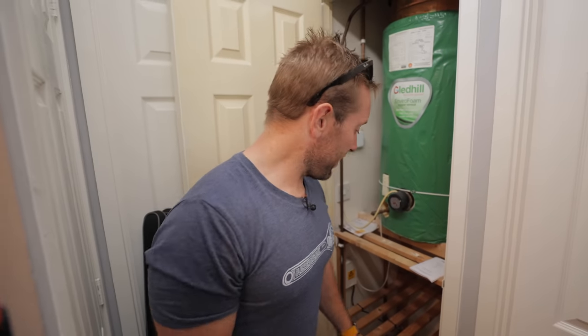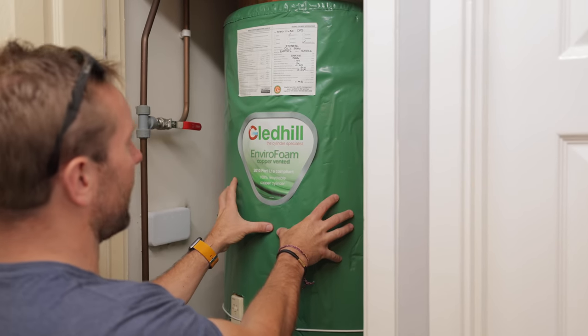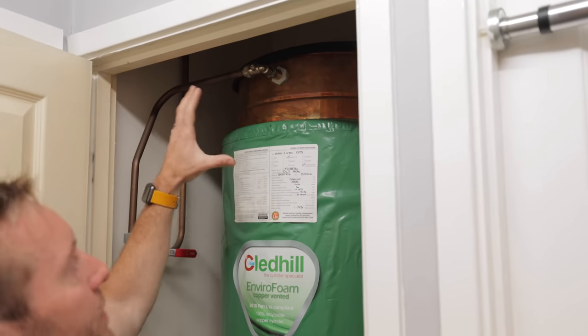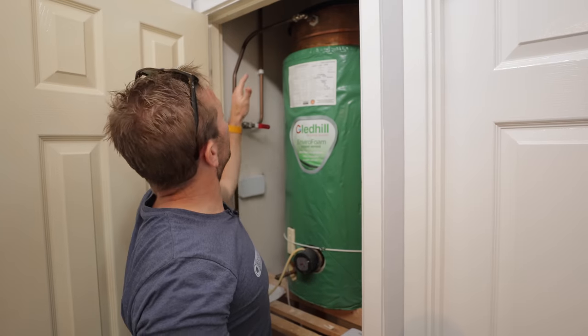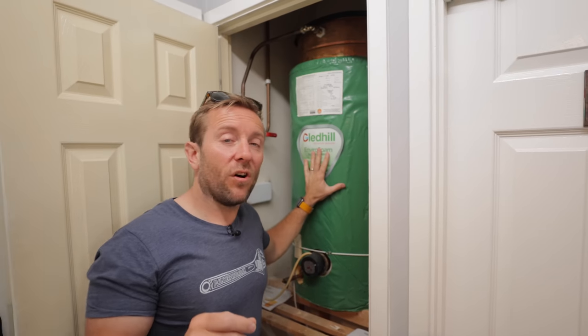One of the things we're doing today — let's look at this job. Some people are here because they want to know how to boost their heating system and hot water without running dry. We've got a tank here — this is where our water is heated up, but there has to be a feed into this section. This is like a basic F&E tank with a little ball valve. As we open up a tap, the ball valve drops and we start topping up the tank with cold water from the mains. At the moment when Lee opens his hot tap, there's literally a dribble — like an old man spitting. So we need to pop a pump on there.